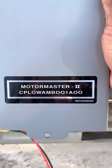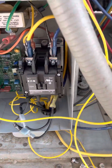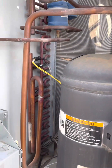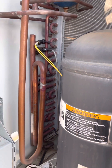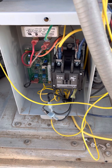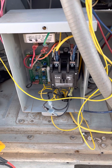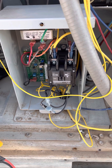You can see here it says Motor Master 2. These are pretty common in Carrier units as well. The way it works: you have your logic board here, and these two yellow wires are your thermistor, which go over to the condenser and sense the temperature of the condenser. The way low ambient control works is if the head pressure is too low, it shuts the fans off, raising the head pressure to ensure you're maintaining the proper pressure differential across your metering device so you can properly feed your evaporator.